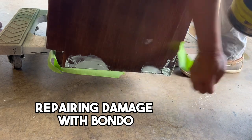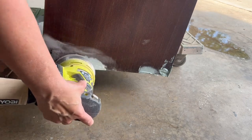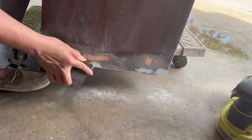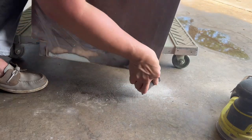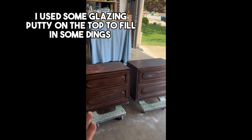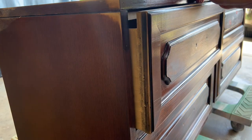I had some damage along the base. I like to use Bondo because it creates a really clean line when you're painting. You put it on, use some painter's tape to create that line, then go back with sandpaper and sand it smooth. You have to make sure to feather out the edges — Bondo sands really smoothly, but you just have to make sure it is fully sanded smooth. I also added a little bit more glazing Bondo on the top for any extra little dings or anything that needed to be filled in.